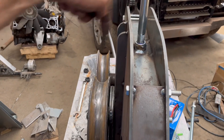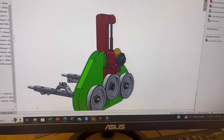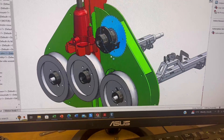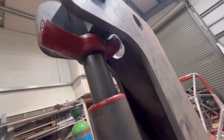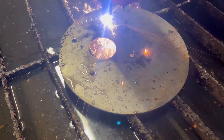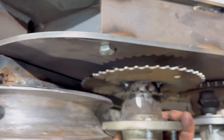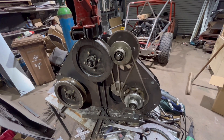I need to make this bolt push directly on the center of that. See how the jack extends - it's a double extender. Luckily the jack was actually the same travel as the slide, which was completely by luck. Here's a new gear setup so the chains are going to go on there. There's a jack in position to the hole for that little bit to go in, and then the jack rests on those bits there. We're cutting the extra cogs out now to get a double reduction on the drive to give it more power, because it just hadn't got the grunt before. I've tacked the outer cog on - the other one's not set up yet, so I need to get the hub on, and it's going to go up here with the two sets of chains on different gears. This gives much better speed and much more torque.